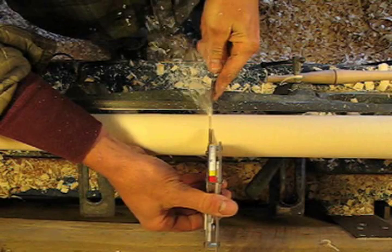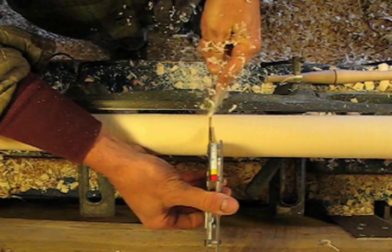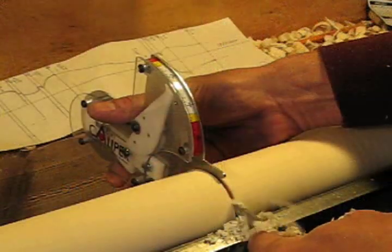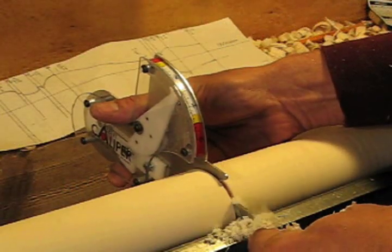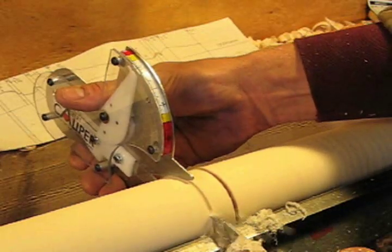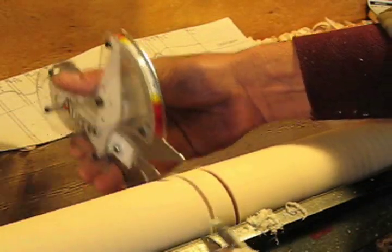When cutting a workpiece to the correct diameter, you simply place the caliper against the back of the spinning workpiece and cut along the front with the parting tool. The exact diameter of the piece will register as you're cutting, and you simply stop when you reach the desired number. As you can see, you can move from one diameter to the next without stopping to reset or change any tools.